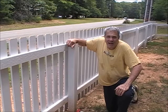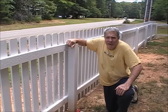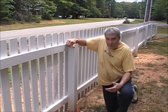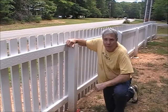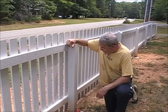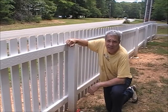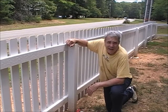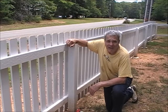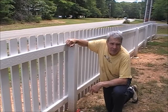Just a quick explanation of the fence design. It's the same design that my wife Goldilocks and I put up 20 years ago, so in a sense this is a continuation of that project. The fence posts are four by four pressure treated lumber — that way they should last a good long time. The two by four pressure treated rail, top and bottom, with posts on seven foot six inch centers. Here in the United States most building materials come in increments of eight feet, so putting them at seven foot six gives me a little margin in case the post is not exactly at the spacing.